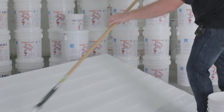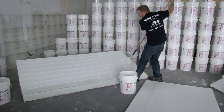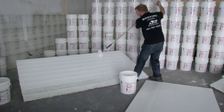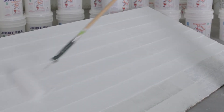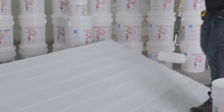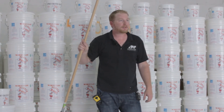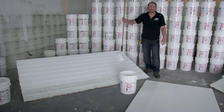When working a larger section on a shingle roof, I always want to take my roller and run down the entire run of the section I'm working on — that ensures you get rid of any smaller movement marks or roller marks in your first coat of R400 and makes sure your second coat looks as nice and uniform as possible. That's it for our first coat of R400 rubber across the shingle roof. We're going to let this cure — it takes anywhere from 30 minutes to an hour and a half depending on humidity levels and temperature.